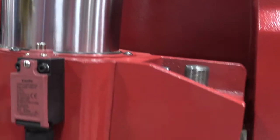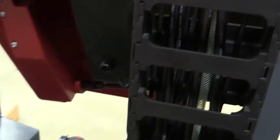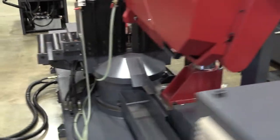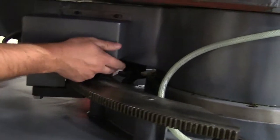Big hydraulic cylinder. You've got oil lubrication to keep everything nice and smooth for years. And just look how big this gearbox is on this bandsaw — just massive — so you've got a lot of torque, with a five-horsepower motor running it. Coming around, you can see the system that actually makes this the programmable tilt — a hydraulic cylinder that drives it with a gear system, and also a brake back here that, when it stops, actually puts a brake on so the saw head doesn't move.